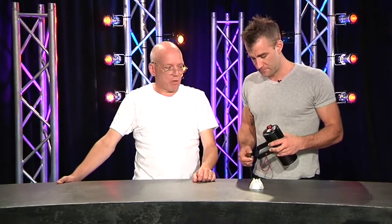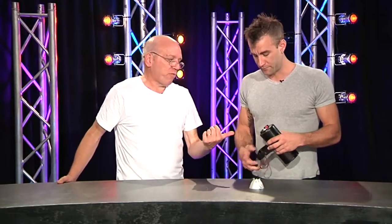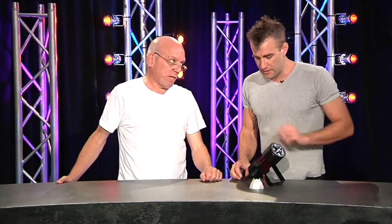So what's missing? No DMX control. This is obviously a film, TV, exhibition-type architectural light. The people who are really going to get off on this are the DOPs who want really good color accuracy. The color rendering index on this fixture is 95 plus, which is higher than anything I can remember seeing on any LED, which means anything you illuminate with it, you're going to see the colors more accurately than you would with a lower CRI.